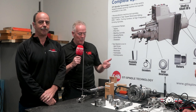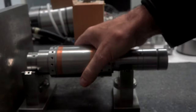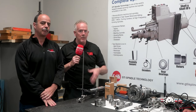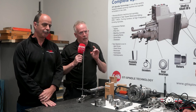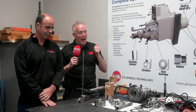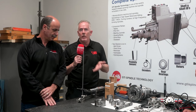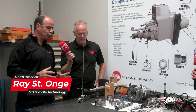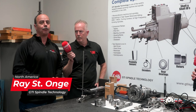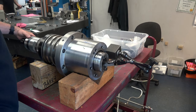When a bearing locks up, a spindle seizes or locks up — in this typical spindle failure it wears away material and damages and bends and unstraightens that shaft or housing that we have to bring back to a micron or less runout and size geometry. So what we do is we grind the spindle shaft down to make it straight, but then the shaft is obviously undersized, so we then chrome plate it to bring it back up in size and then re-grind it back down to OEM tolerances or better.